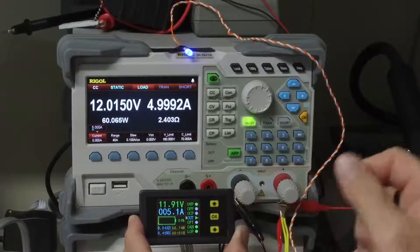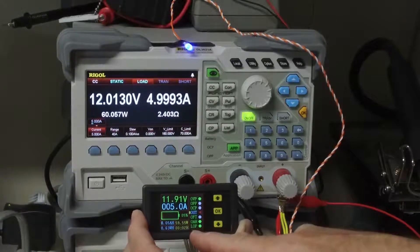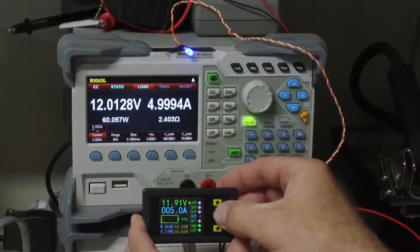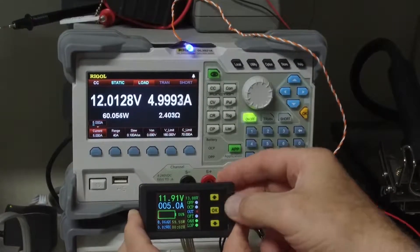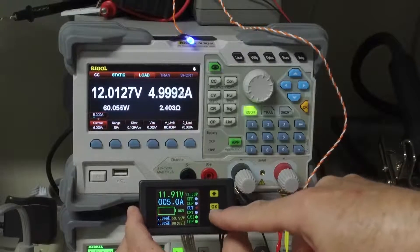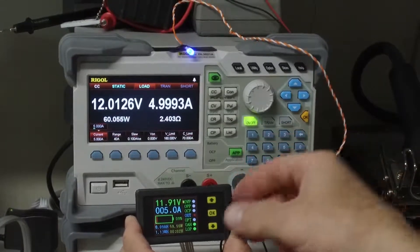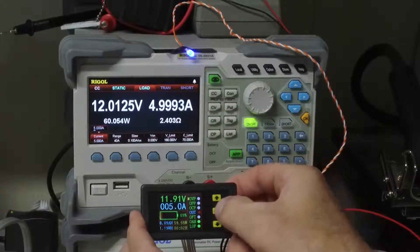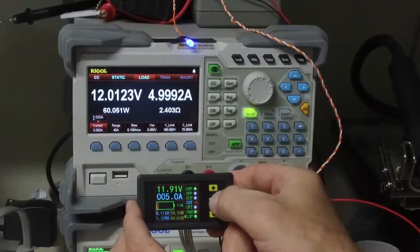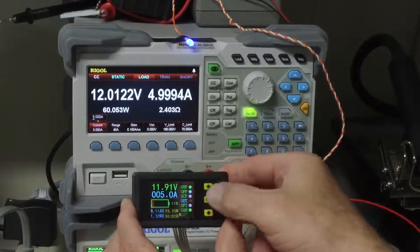If I want to re-enable it, I push that button. Right now I have the over-voltage protection turned on. I can move the cursor up to the OVP, press and hold that button, and it now says 13 volts. So if it ever sees a voltage above 13 volts, it will turn off this relay. You've got to push an up/down button and hit OK to exit — kind of a weird quirk. Now I'll come down to the under-voltage protection, push and hold, and I have that set at 11 volts. I'll exit that.